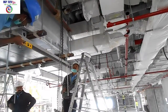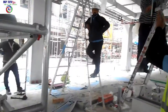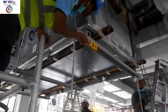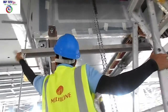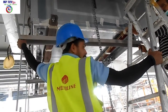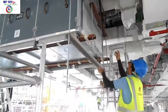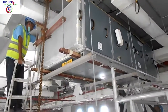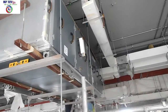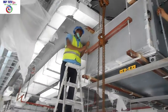You must also maintain a slight slope towards the CDP condensate drain pipe area — otherwise the water will stay inside the AHU. Give a small slope towards the CDP for proper flow of condensate drain to the pipe. Now the AHU installation is almost complete. We are also removing the temporary base frame, since we have already fixed the threaded rods to the bottom support of the AHU and can safely remove the temporary frame arrangement.